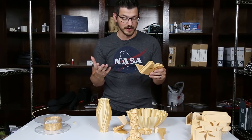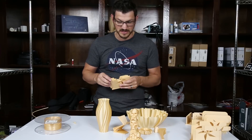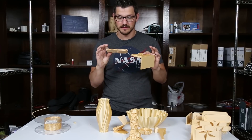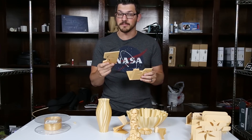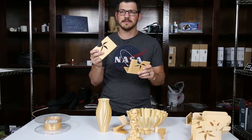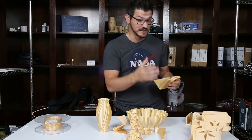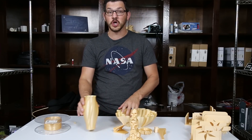Eventually I will get this thing to print — I'll probably add supports to make my life easier. I did use about half the roll on this. What I can say is it printed extremely consistently. Across all of those attempts, I did not see any under-extrusions. It actually adhered very well compared to other silk-like filaments, and it printed miraculously over a lot of the overhangs and weirdness in that model. So we're going to focus on the good, not the bad.